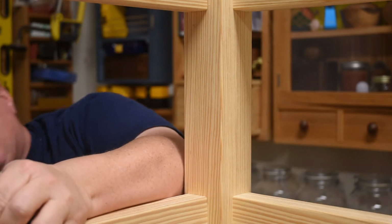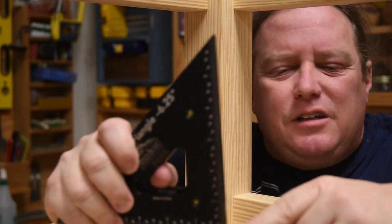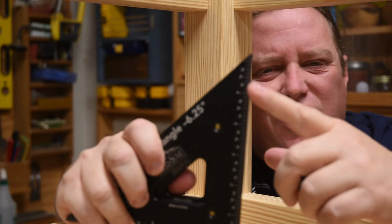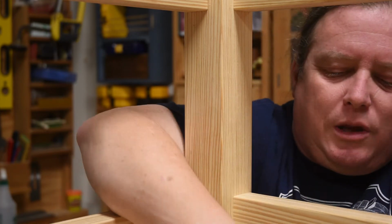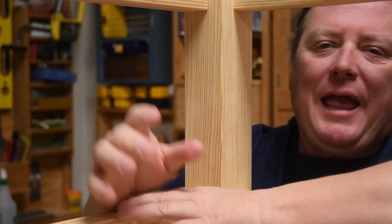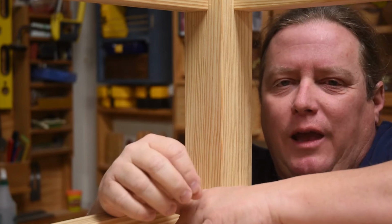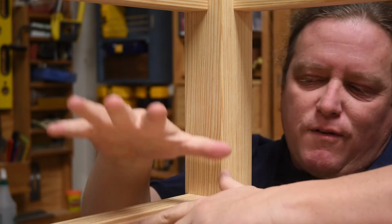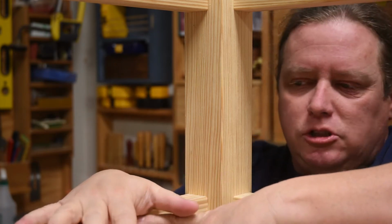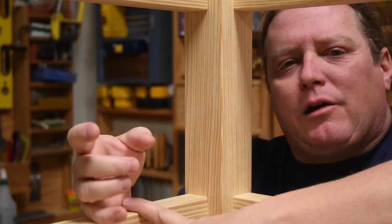But then I come over here, and I can see a little bit of light on the bottom, and I go over there, and you'll see a little light here, a little light there, which means you're a fraction of a degree off, which kind of means you cannot make a perfectly square panel if you want to minimize your gaps as much as possible. And as a practice piece, that's what we're going to be doing. So I'm actually going to be fitting these pieces. I'm not just going to take a measurement. I'm going to fit them so that I can capture all the angles I want.